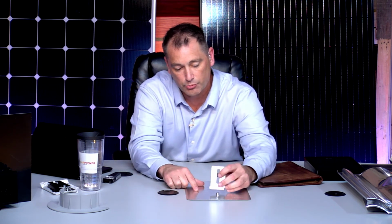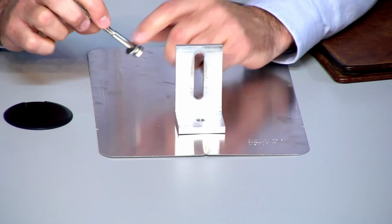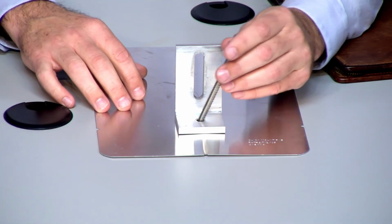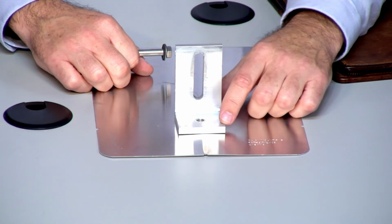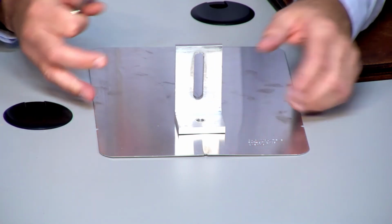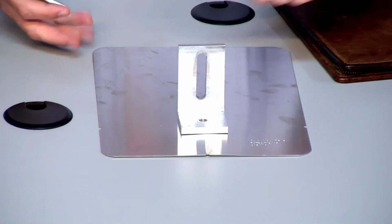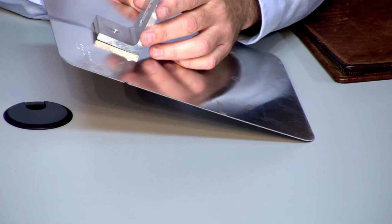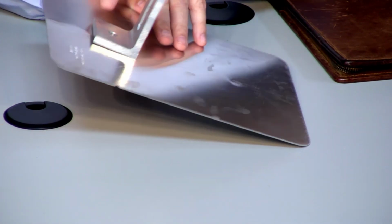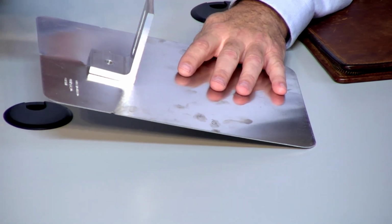When you have a 3/4 inch riser, and then you put this on here, and the lag that we're using has a rubber gasket on top of it. You put this in here and tighten that down. You have to have almost 1 inch of standing water on that roof. And if it's a roof that's tilted 26 degrees like the average roof in the country, and you've got 1 inch of water, you'd have to have a monsoon hitting you to come an inch over and then get past this rubber grommet.